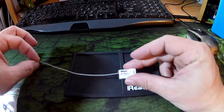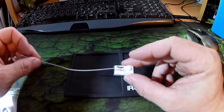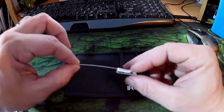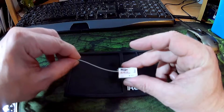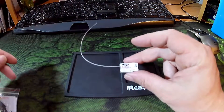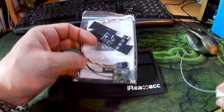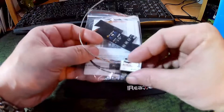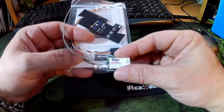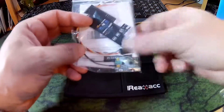A little update regarding the receiver I chose to use — what I thought would be an ideal choice turned out to be a bit of a failure. It fits perfectly and it's nice and small, but it goes into failsafe and it's not very reliable. It's documented on RCGroups among other places. So I've swapped out the RX800 for an X4R SBUS. As you can see it's not that much larger, it fits perfectly fine, and the added benefit is proper telemetry.